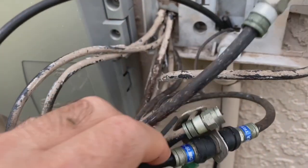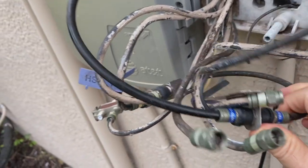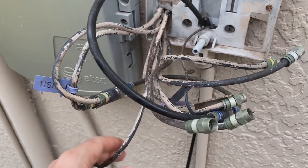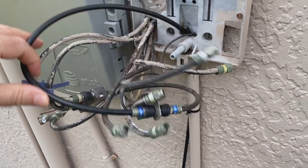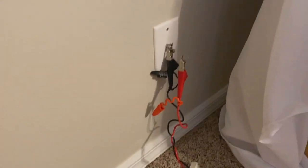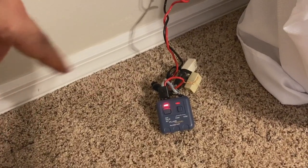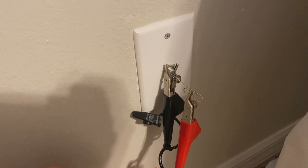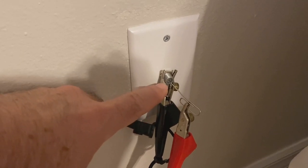So that's going to be my starting point - this is what the cable company is delivering to me. Everything else I'm going to disconnect. Then I'm going to use a toner to tone out all the individual cables - at least the ones I need. The trick is to disconnect everything, then one by one identify them, put little markers on them, and connect them as needed. I'll show you the toner and how I'm doing that. I'm using one of my telecom toners and probes. I'm sure there's a proper tool just for coax, and I'd be happy for cable techs to leave me a comment about it.